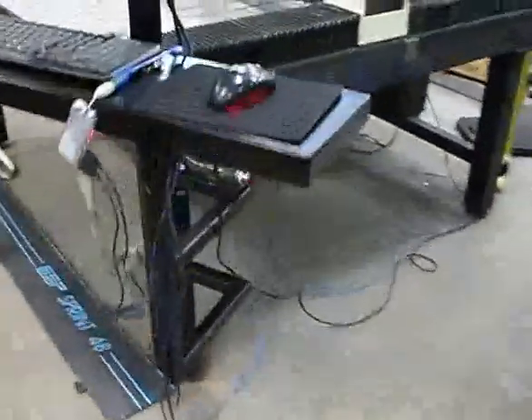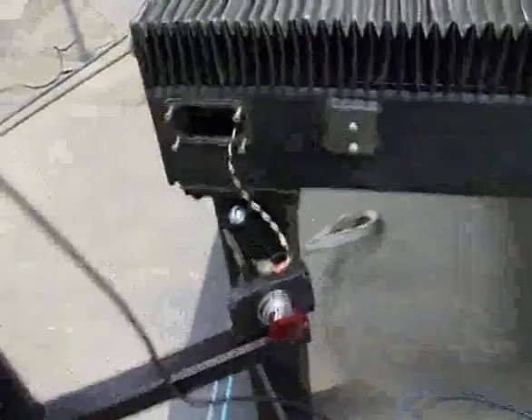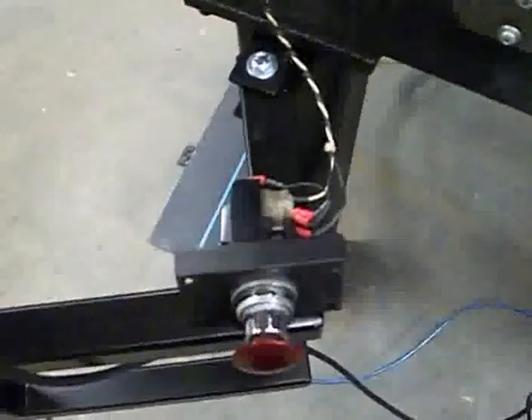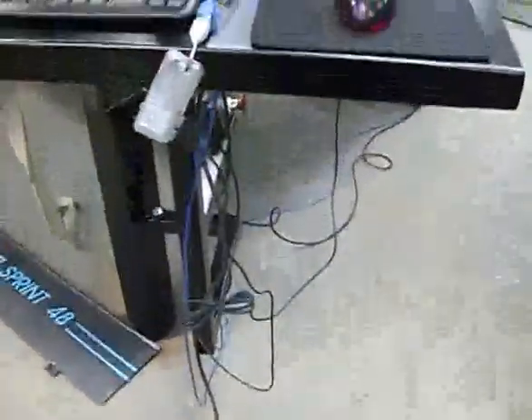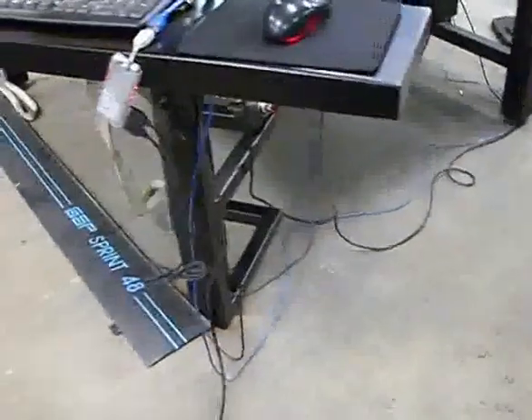I made this custom console here. I don't have one-and-a-half inch square tube, so I bolted it onto the leg itself. I needed some little brackets — drilled and tapped some holes into the frame of the leg there. The e-stop switch has a broken tab at the back so I'm gonna have to replace that — it works but I'll need to change it. The wires are on the outside right now but I'm gonna run them through the frame through a conduit. I had to get super long cables — those are five meter cables for the USB power and also the VGA for the video.